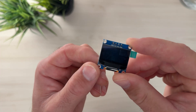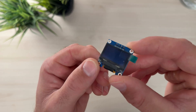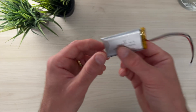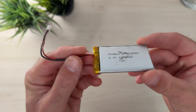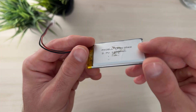What we can do is integrate this little screen on our running stroller attachment so that we can see the output of this pulse sensor, sending to the Arduino and then outputting things like distance and pace on this little screen — so we don't even need a running watch anymore to really accurately track our distance and pace. The final components will be power for this system. To do that we can use these awesome little 3.7 volt pouch batteries.